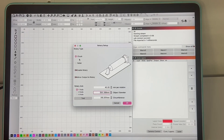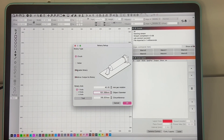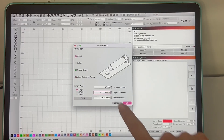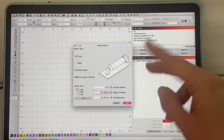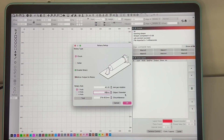Under Rotary Setup, ensure that you have it set to Chuck Style Rotary, which is the style we're using with the Rotary Pro. Click Enable Rotary and ensure it is on the Y-axis with 40 millimeters per rotation. Under that is where you put your object diameter or circumference — LightBurn will calculate the other value for you. So if you put in 90 for the diameter, it works out the circumference, meaning you only need to measure your tumbler once and enter one of those measurements.